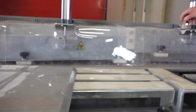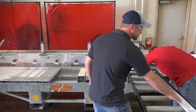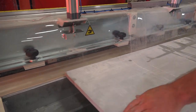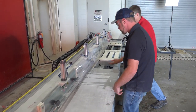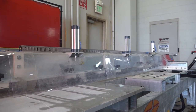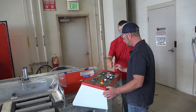Once the saw is back in home position, we raise our clamps back up and position our parts. We'll slide this clamp over a little bit. Once you drop the clamp again, I'll turn the water on and we're going to do the same thing we did before — start the arbor up and hit X plus.